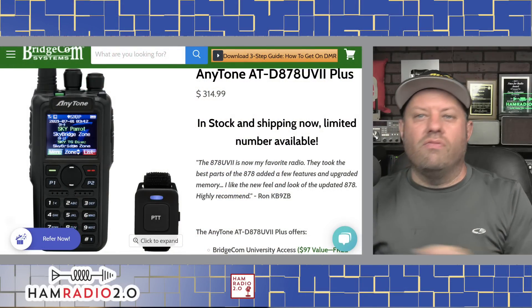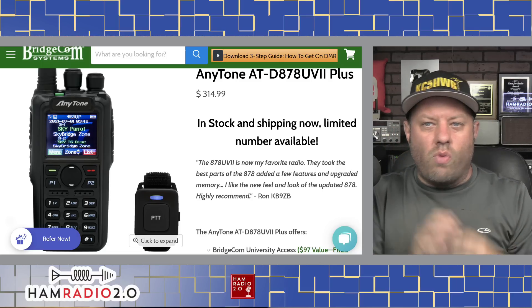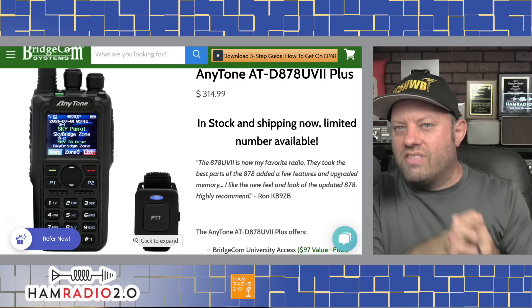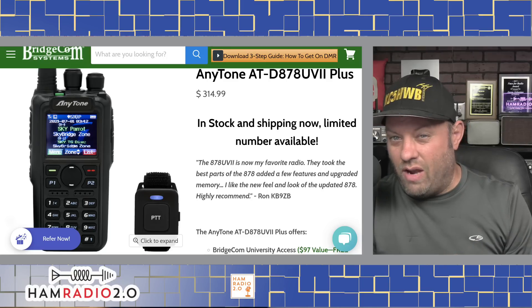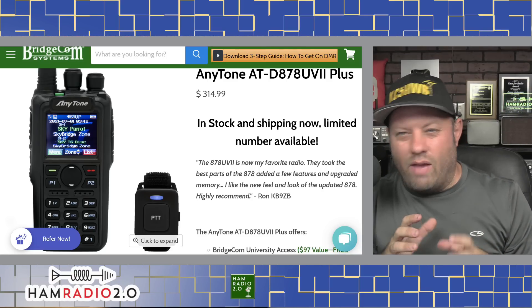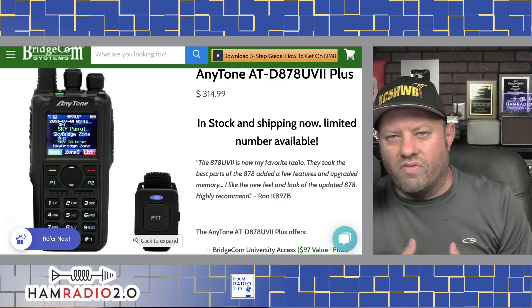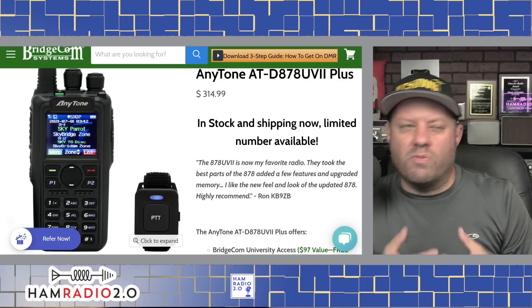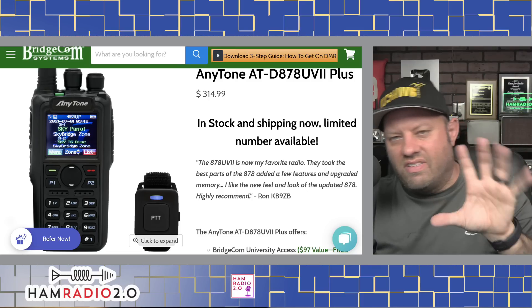AnyTone came in and did what the big three in Japan were unwilling to do — they made a dual-band DMR radio that is full-featured, with full APRS transmission send and receive, full beaconing, and full text messaging with the latest firmware. This is one of the first radios out of China with true analog APRS send and receive. It holds over 4,000 channels, compared to the ICOM and Yaesu which hold around 1,000, because DMR requires more channel slots for the different talk groups available on each repeater or hotspot.